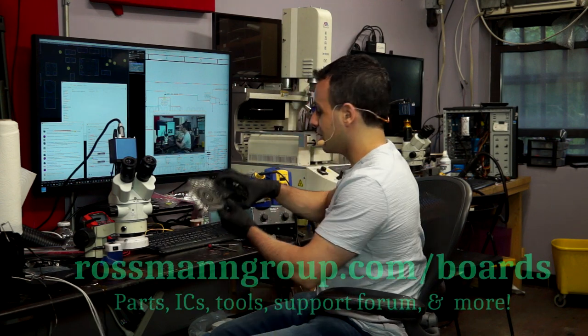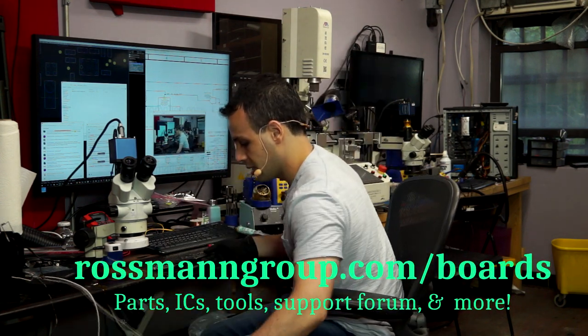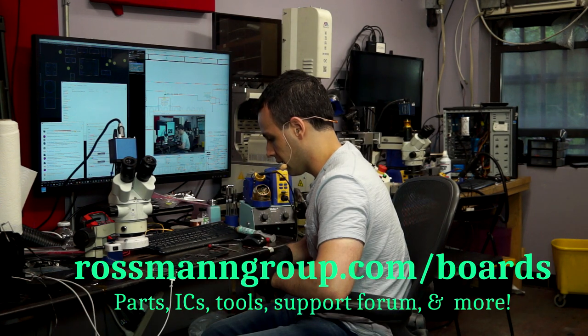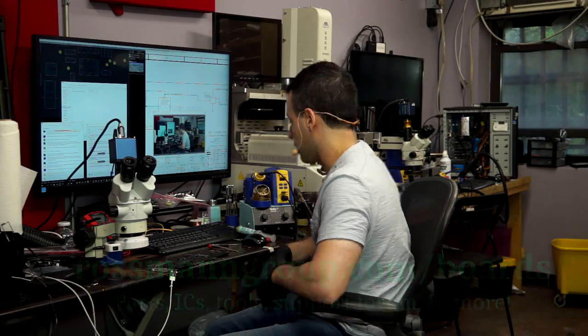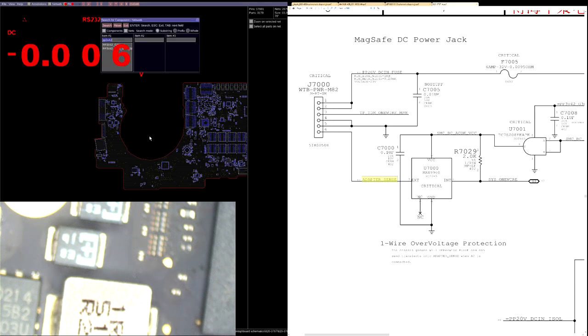So let's get started with the 820-3787 that is not turning on. We're going to plug it in and see what it does. And we get no light on the charger, and it is dead. This is going to allow the charger to talk to the SMC. Let's look on pin 1 of U7000.